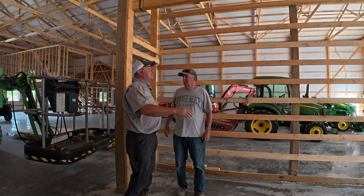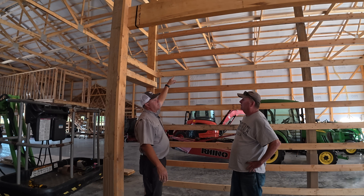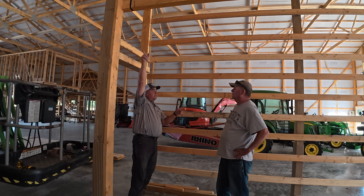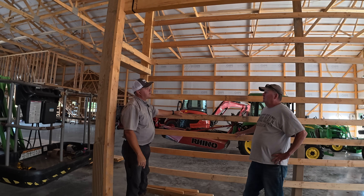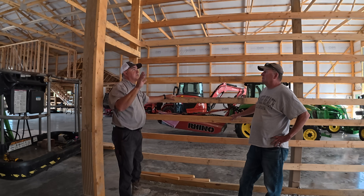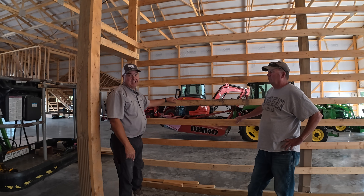So here's the design I got in mind. I've got 2x8s. I'm going to take whichever one of these is under and behind — there may be two I have to take off — put a 2x8 on each side, sandwich that, and then run the joists butted into this one and sitting on those 2x8s, at least every two feet. First thing people are going to ask is how did I decide I got enough beam and enough strength, and I'm going to show that a little bit later in this episode.